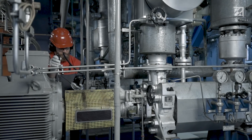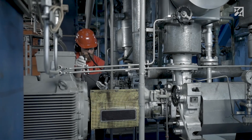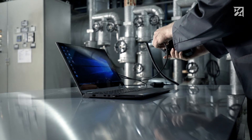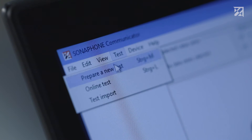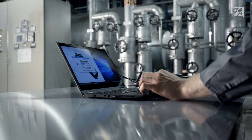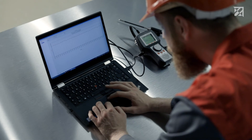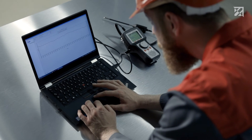Depending on the testing job being carried out, the tester can adjust the detection frequency on the Sonophone E. An active route for the machine and system inspections can be created in advance on the PC using the software communicator. The data is transferred from the PC to the Sonophone E via the USB interface. Once testing is complete, all test data can be imported back to the software communicator and evaluated in either graph or table form.